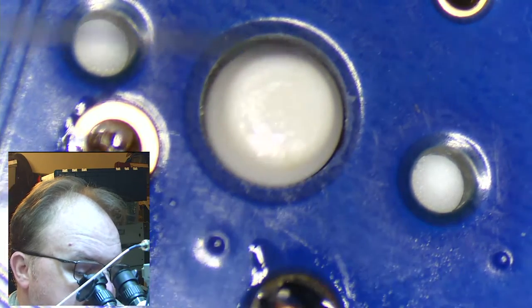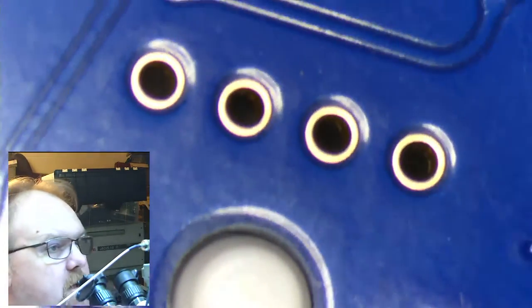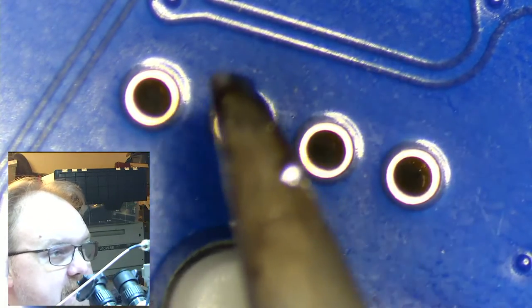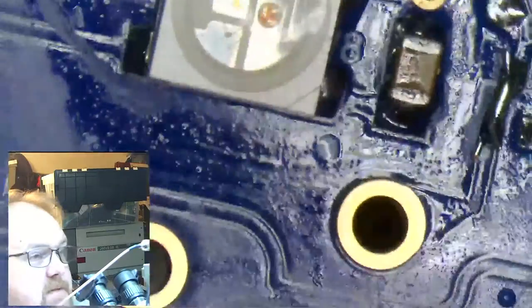They don't do what we did with the LEDs mounted on top. They actually reverse mount LEDs from the bottom. Where those four holes are, it would just be some pads and a hole, and the LED would mount backwards and it would shine through the board up through this hole and into the keycap. But see how that's centrally located, so you could put an LED right in the middle there. There are even RGB LEDs, so if you want more than one color, you know, there's four pins, so you can have a common as well as a pin for each color. All sorts of neat stuff about keyboards that I didn't know before we started this adventure together.